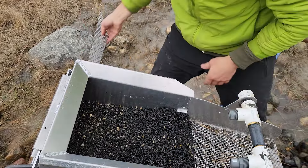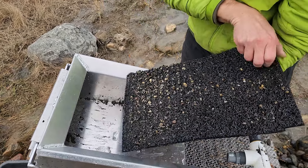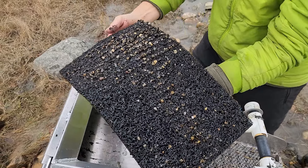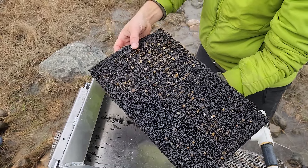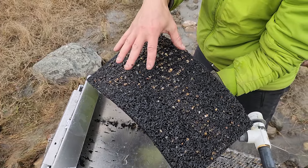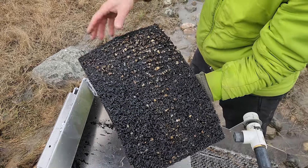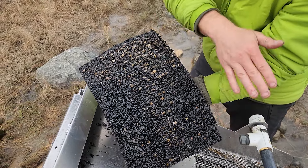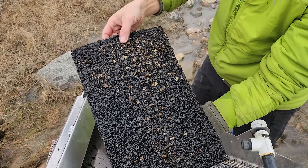It's that simple. Here's your hopper moss — this is backed moss. A surprising amount of gold gets captured up here. But the whole point of this being in your hopper is partially as the wear guard, and partially this will hold on to black sand, which slowly bleeds into the rest of the sluice. So even though you're surging it with big shovels, it will slowly bleed into the main sluice, allowing your main sluice to capture even better.